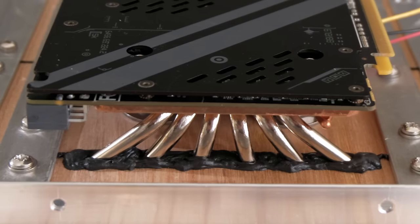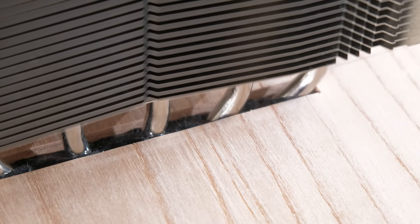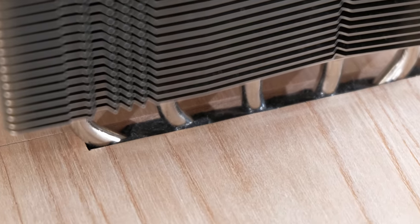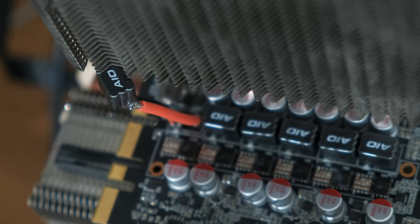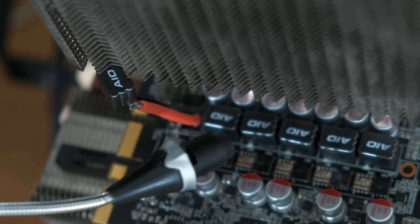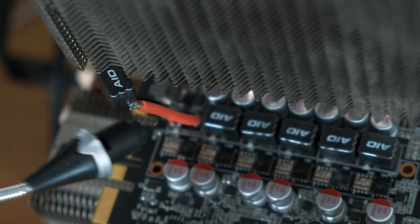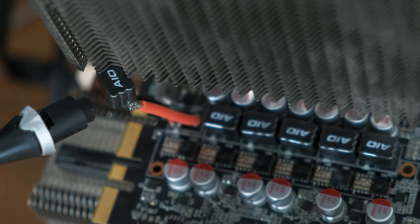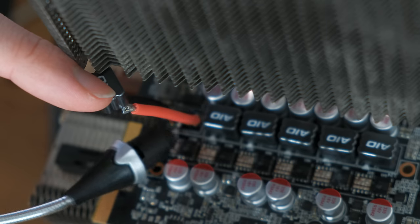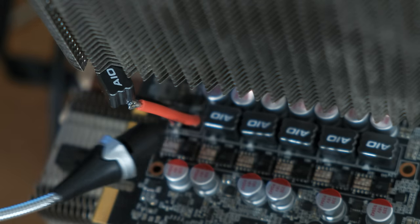Reducing noise was the purpose of that black tack that I added earlier, by the way, as it makes the graphics card chamber airtight and so boxes in the fairly intense high-pitch electrical whining generated by the card. Although typically referred to as coil whine, from my testing it appears to actually emanate from the MOSFETs, as I desoldered a coil and used a microphone to figure out where the sound was coming from. It's not unusual for a graphics card to sound like this, but it's usually masked by fan noise, which is why it was important for me to reduce it, as it became very apparent with a quieter cooler.